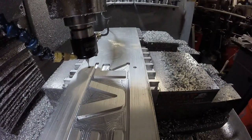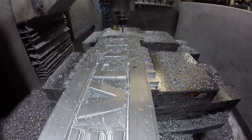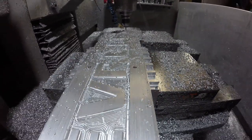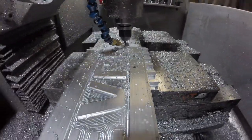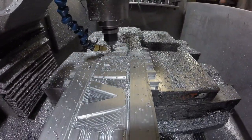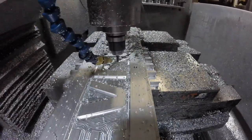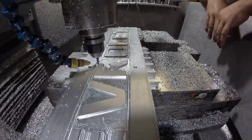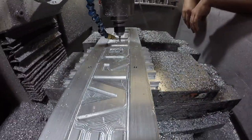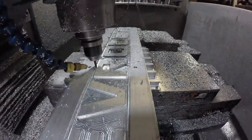I referenced off of a mounting hole when cutting the other half, so any disruption should be minimal and pretty hard to see just because of where it's located. It actually came out pretty good — it was really hard to see where the cut stopped and started. That's a good trick for cutting a part that's too long for the travel on the Tormach, or any other machine.